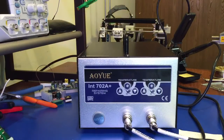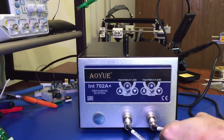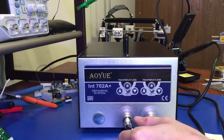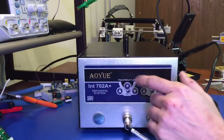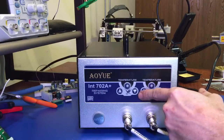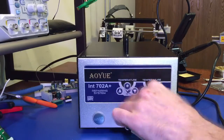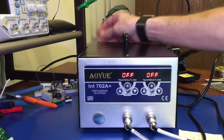It's running a 150-watt transformer, and in that 150-watt transformer it actually has three different rails of voltage. You have two independent 24-volt rails — one goes to the tweezers, one goes to the soldering iron — and then a 10-volt rail which controls the microprocessor for managing the two channels, temperature, and thermistor. So let's go ahead and turn this on.